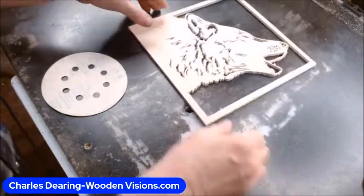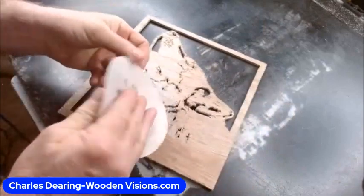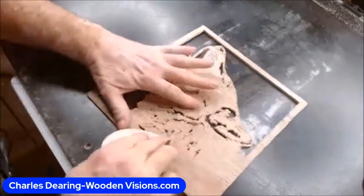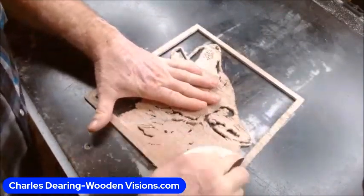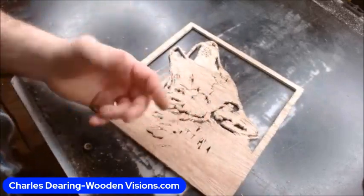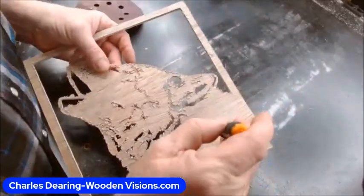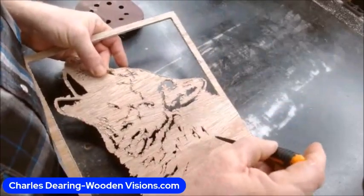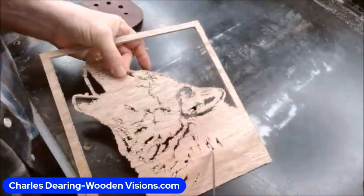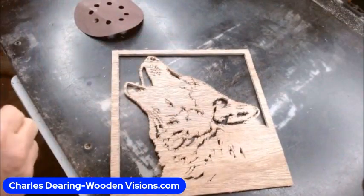Let me use the wolf here for a more broad area. You can also go back to hand sanding — I'll just do one little area. Going across there, it is knocking the fuzzies that are coming up, but they're still down in the hole. Again, you can go back to the needle file — just one cut here to show you. However meticulous you want to get, that reduces the fuzzies. A more aggressive way would be with a palm sander, and I apologize for the noise ahead of time.